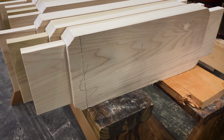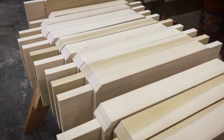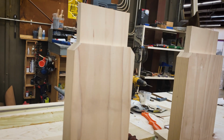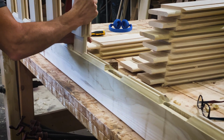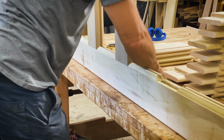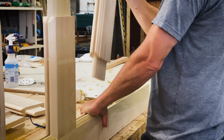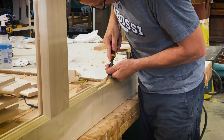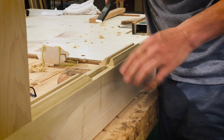The cut tenons are now the same width and dimension as the boxes. Next, they are dry fitted to double check the work so far. You can see the 45-degree angle and the rounded slot where the panels will later go. Cleaning up the joints helps ensure there are no high points, resulting in even seams with no gaps.